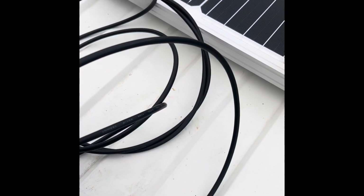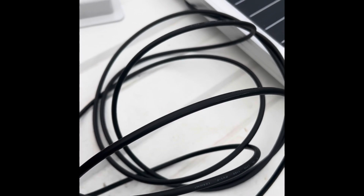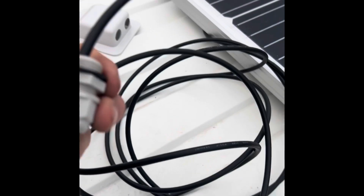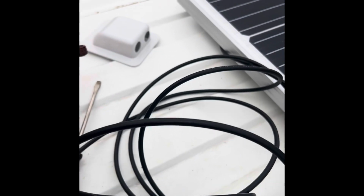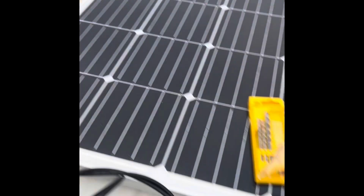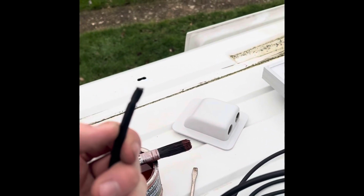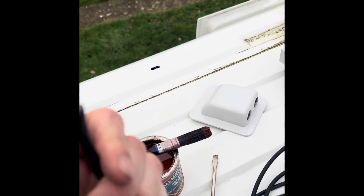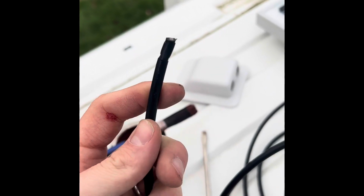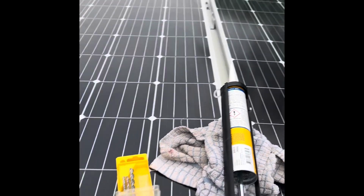The other thing I've done is I have stripped the MC4 connectors off the end so that it can pass through the solar entry terminal and get through these little connectors, and then I'll feed those through down to the van. I'll then take them off, as I say, because once I connect the cables back in the middle, then these will be generating power, and I'll just label them positive, negative again, just so I don't forget. And then once I do connect them, I will still just test them and remind myself which one's positive and negative. So the final step of getting these panels sorted and into the van.